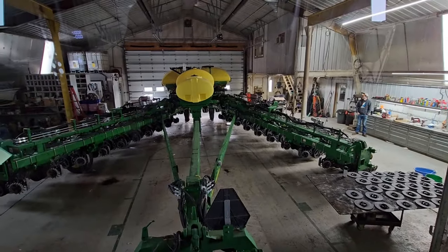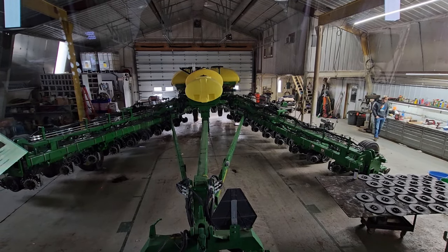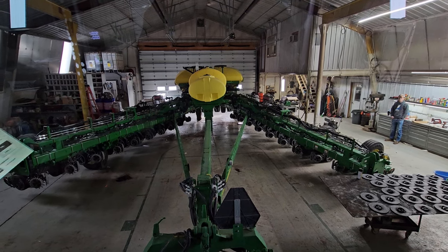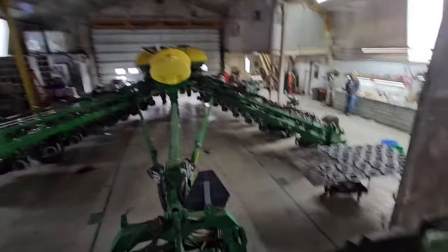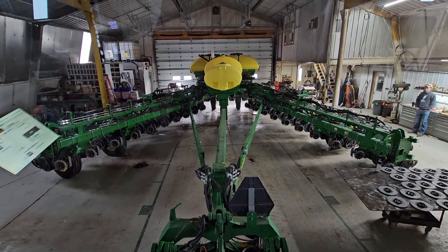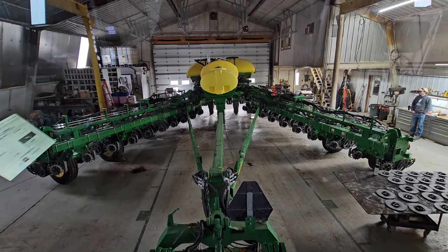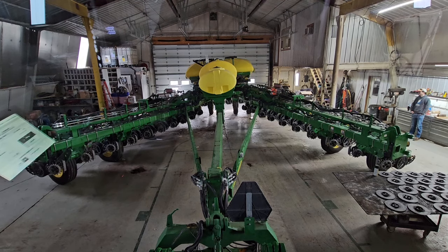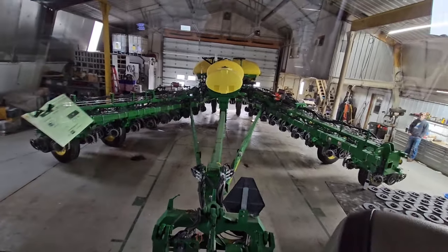There's Brock. We should get this. Just trying to re-phase everything — basically setting it all the way down and all the way up. I've got the cylinder stops in so it doesn't actually go on the ground except for this one wing. It's still getting out of phase. We're just going to leave it there — good enough, that's what we need.